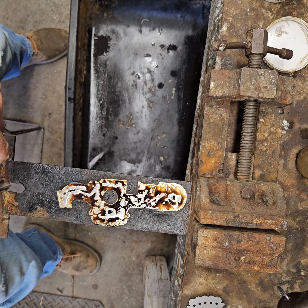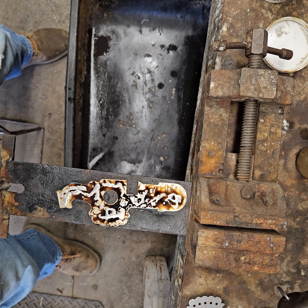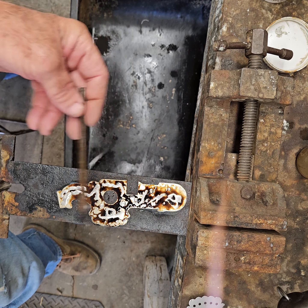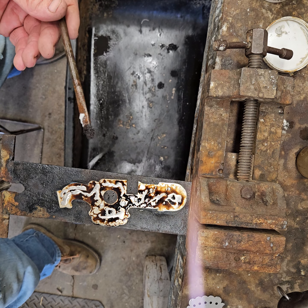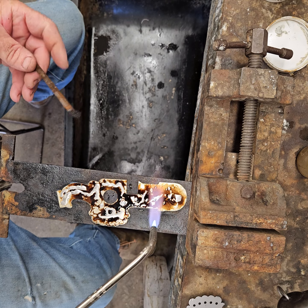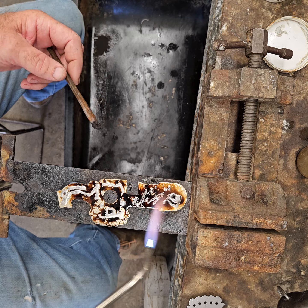As you can see, I've got solder melted on there but it's a little bit lumpy and uneven. So I'm going to take a standard flux brush, warm this solder up, and spread it all over the back — what they call tinning the back of this piece of silver — so it's ready to solder down onto the steel cheek. This brush is wet, not dry.